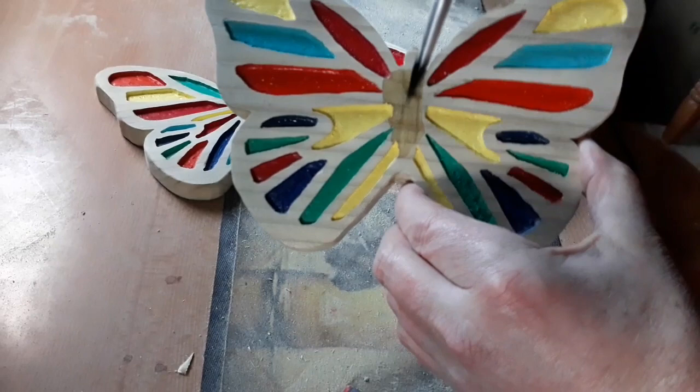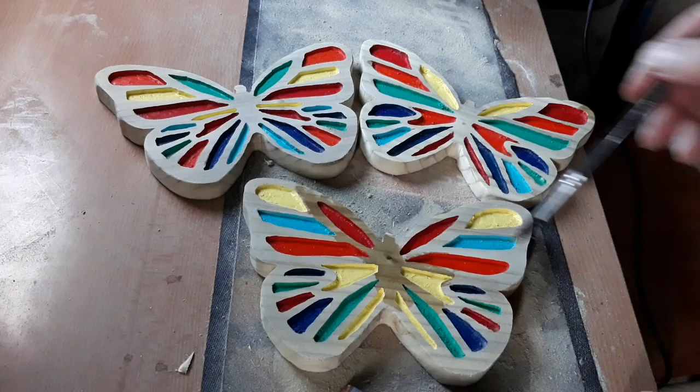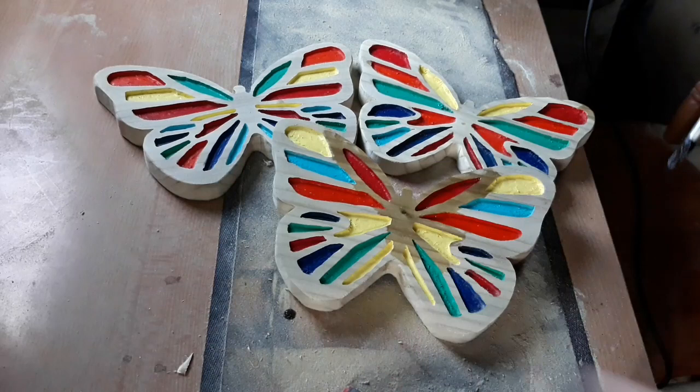You can see how that's darkened down straight away. This wood will soak it up lovely. Just get it on — there's no big concerns about it. Get down the sides, you'll see the difference on the sides with this linseed oil. You'll see how that's going to go. Then we'll give it a wipe over with a cloth and I'll come back when this is dry.